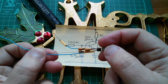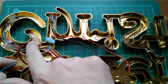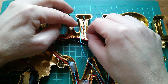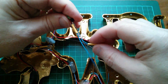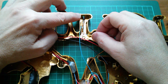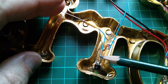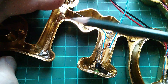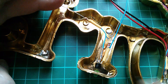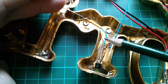This is the new style cluster, it's getting quite good. This one's going in the CHR — this is the R of Christmas — so it's going to go in there. Perhaps the transistor will go on top on this one. Here's the resistor to base which is coming from the previous section, because the pattern rotates around this way: on the bottom it's running backwards along Christmas, and on the top it runs forwards along Merry.